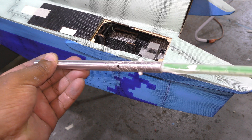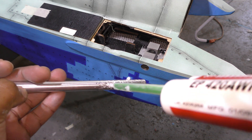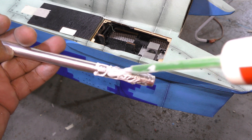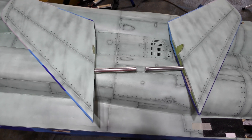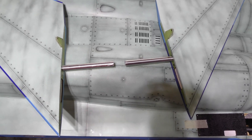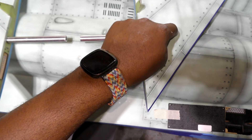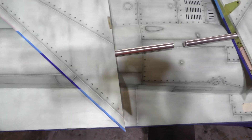What I'm going for is squirting some epoxy in here — the goal is to really get that to come out and also coat the surface — and we're going to rotate this all around in the stabilator, which should make for a good connection. I have glued the aluminum rods in with Infinity Bond 420, and once that's dry we're going to drill from the top into the aluminum and put maybe a couple of screws in there just to make sure that it doesn't rotate in any way.